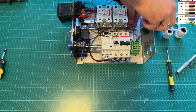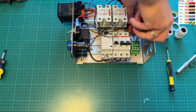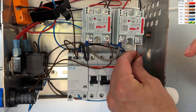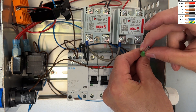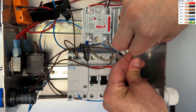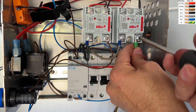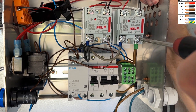Now all the things that we can wire before installing the controller to the oven are done. The only things left are to install the controller and connect the temperature sensor, main power cable, and heating element cables. First, I connect the heating element phase wire to the solid state relay — I take the heater wire and the lamp wire, and because they are different diameters, I put them in the same ferrule to be sure both get secured properly.